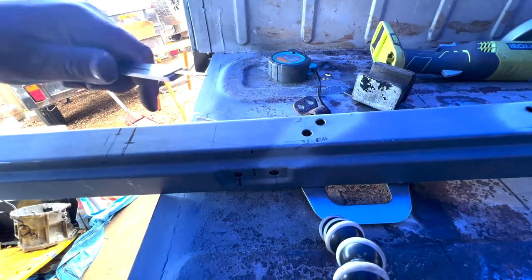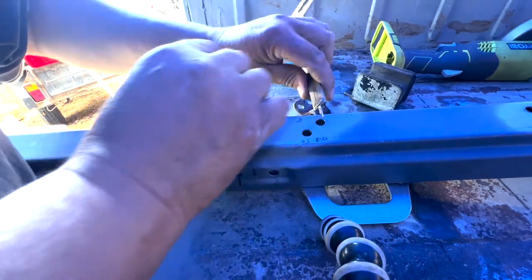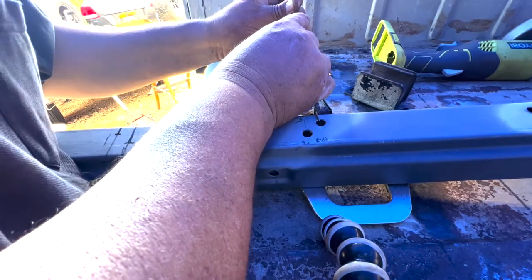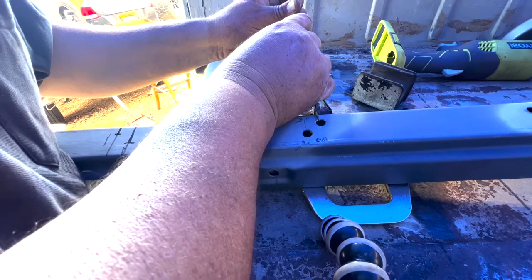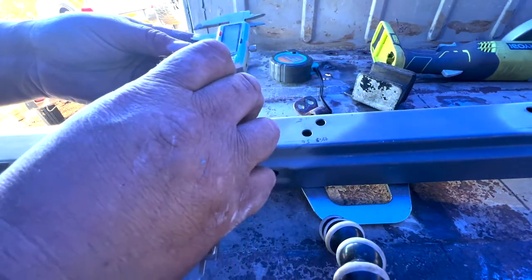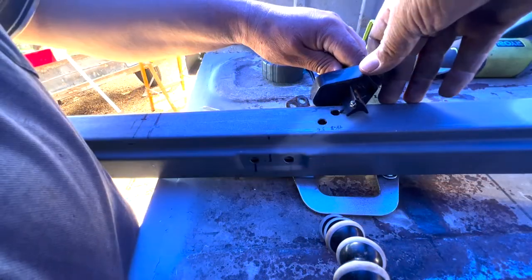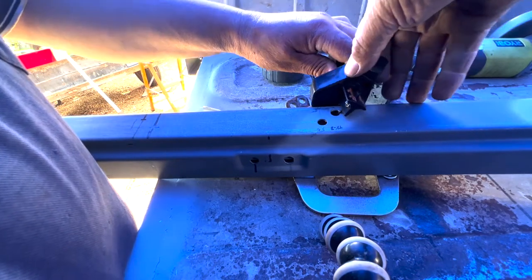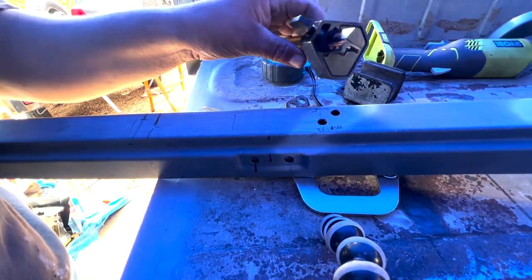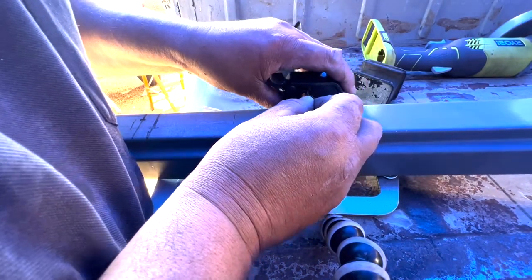What I'm doing is measuring the centers of my holes here with my vernier, basically working out roughly where the center of each hole is. I lock that in position on the vernier, then translate it over to the next hole. Another way is the old wood-jobbing method, getting that centered like so.